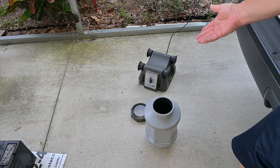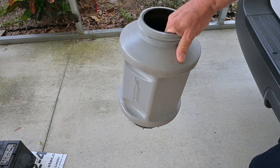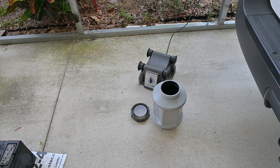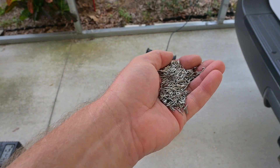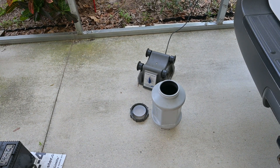And this is what I'm talking about here. All it is is a motor that's turning one shaft and then we have another axle here with a couple of rollers on it, and it's spinning this drum right here. In this drum we have the material we wish to be cleaned, which in our example here is our RF adapters. We have the stainless steel tumbling media, which is nothing more than little stainless steel pins. Then we just add a little bit of water and perhaps just the tiniest dash of dish soap and let it run for about an hour.